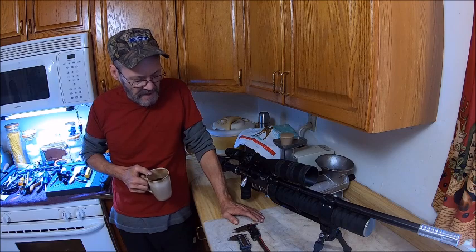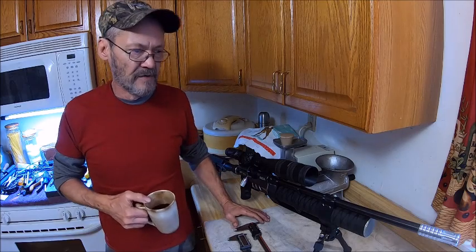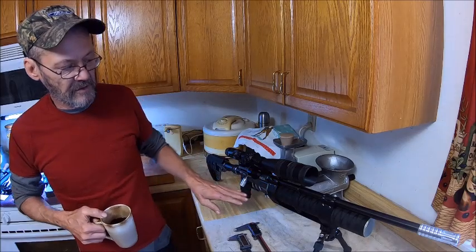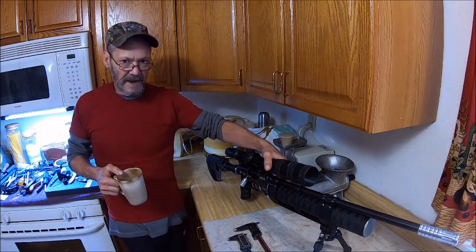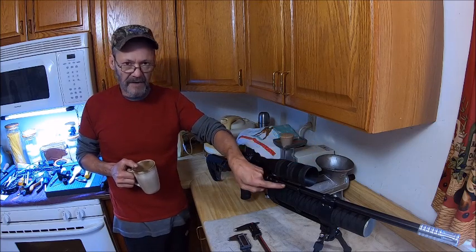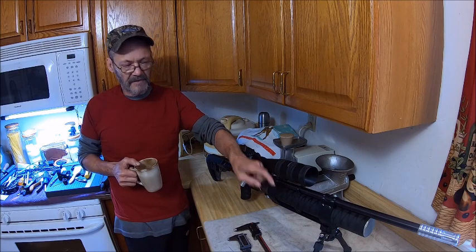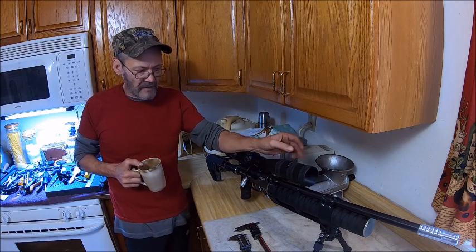I'm Bob. And this is going to be a repeat video, but we're going to go a little bit more into detail on this one, on how to measure your gun for a barrel band. So, if you need a barrel band made for your gun, don't matter what gun it is, I only need 3 numbers. I need the size of the barrel, I need to know the tank size, I need to know the gap between the tank and the barrel. That's all I need to know. Rest of it's cosmetics.